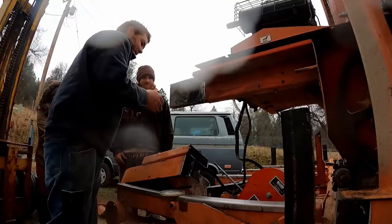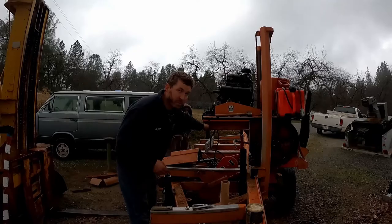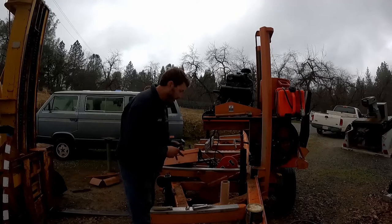Final assembly, take two. We had to drill these back just a little larger — getting these holes to be as precise as possible is really important. I did these two holes three inches apart, and we're pretty good. We're using half-20 bolts to hold it together, so here we go.